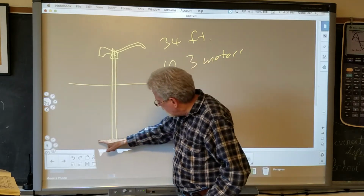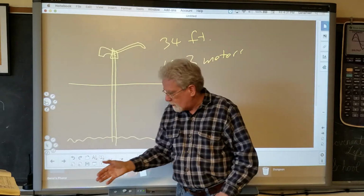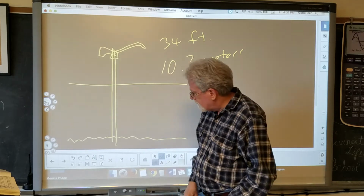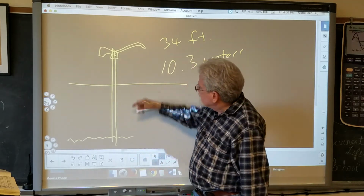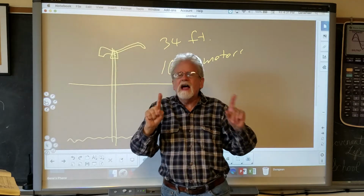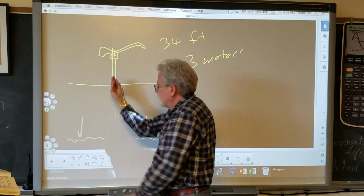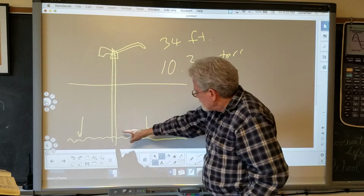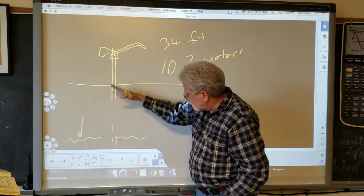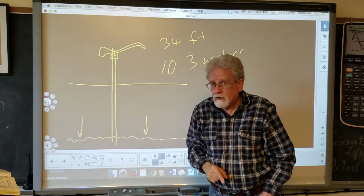Well, there's water in the ground, the water level down here, the water table, you go down deep enough, there is water down there, mingled in with the rocks and everything. You push this to lower the pressure inside the pipe, that allows the atmosphere to push the water up the pipe. Which means, if this water is any farther down than 10.3 meters, if this water table is any farther down than 34 feet, your pump will not work.